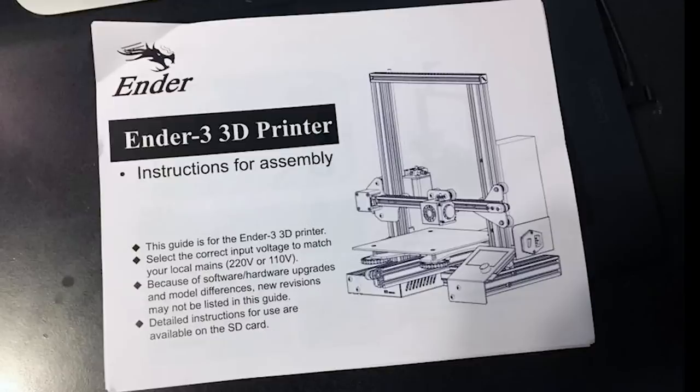I really like these replacements. So if you want to wait and get the replacements from Amazon before you begin, you can do that, or you can change these out at any time after your machine is built. I also have links to upgrades on Thingiverse such as cable drag chains. These aren't essential, but they will make your printer more reliable over the long run. The drag chain cables will reduce stress on your wiring, and there's a fan cover for the electronics box to keep dust out.